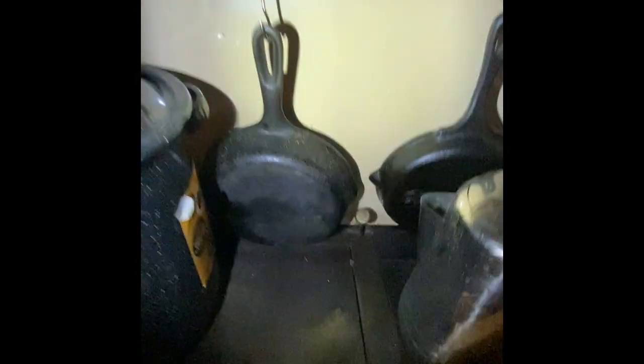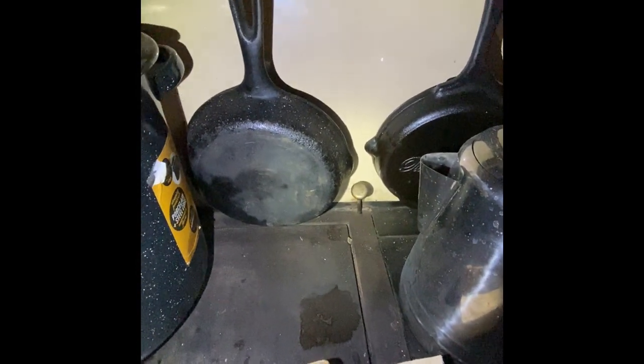The house is already pretty hot — this is going to do exactly what I want to bring up the temperature. The damper: I have a damper on my stove pipe right here. If I pull this up as it is now, it's transferring all the heat into and around the oven. This is my other side air vent and I have it closed, trying to keep in the heat. I'm going to start shutting this one down — I close it just so it's not smoking.